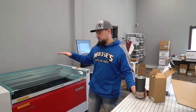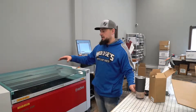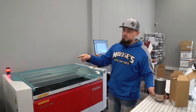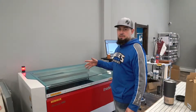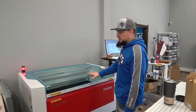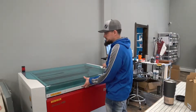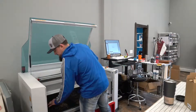I'm going to walk you through the process. The Trotec laser is set up right now to do flats and some cutting, so the first thing we have to do is power it off, change tables, and drop the tray all the way down to make sure there's room for the rotary attachment to go in.